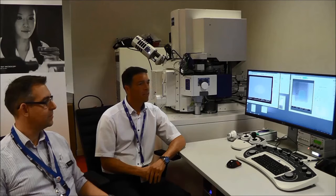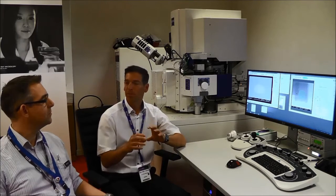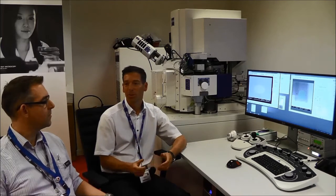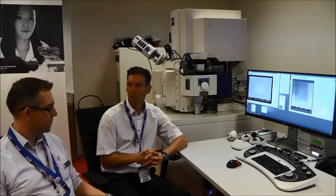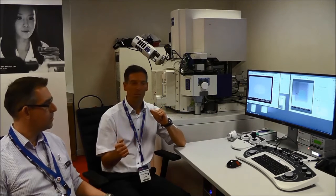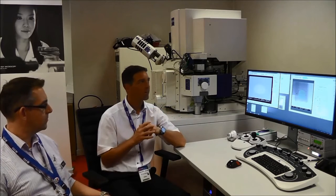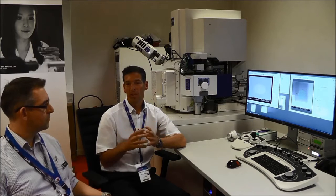We are offering a series of sessions here at EMC to show customers, focusing on specific topics. We cover, for example, automatic sample preparation and our correlative 3D workflows. Correlative workflows are very important for Zeiss. We have been working on correlating light microscopy with electron microscopes, or X-ray microscopes with electron microscopes. Here we want to show the workflow that combines an X-ray microscope with a FIB-SEM, since this allows you to characterize a sample over multiple scales in 3D.